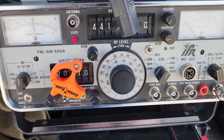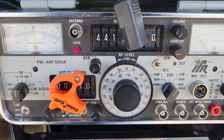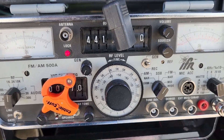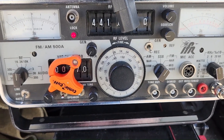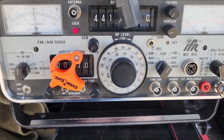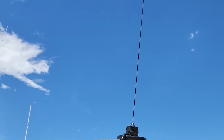Out of site here, I'm a couple hundred feet away from the antenna I'm talking to. You always want to make certain that the test equipment antenna — or whatever you're testing with — is line of sight to the antenna you're dealing with, because a vehicle moving around or other obstructions can skew your signal and results somewhat.